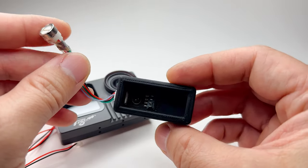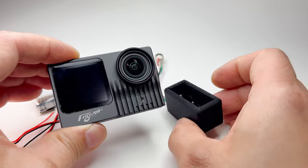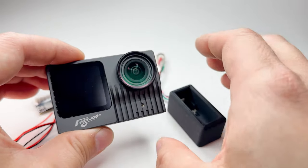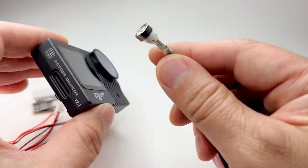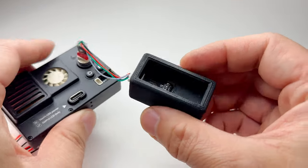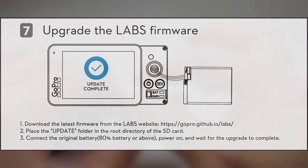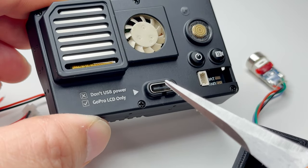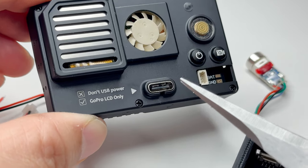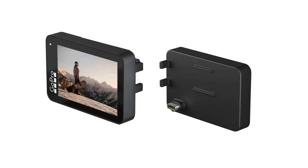The firmware updater is a big improvement over the Flywoo naked GoPro V1, where you had to take apart the case to update firmware. Now there's a magnet that hooks right onto the back — very slick. You put the original GoPro battery in, download the latest firmware, place it in an update folder, connect it, and let it do its thing. Note: don't power it by USB — that port is only for the optional GoPro touchscreen.